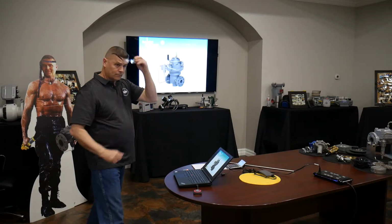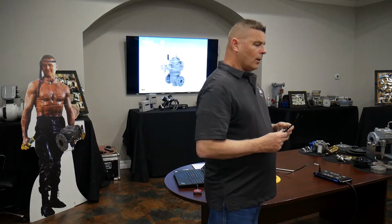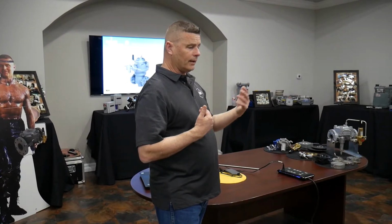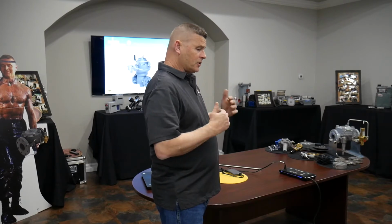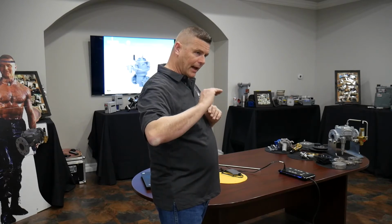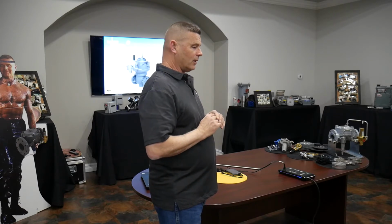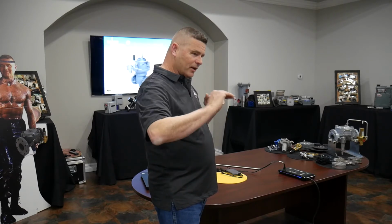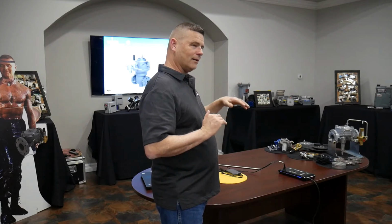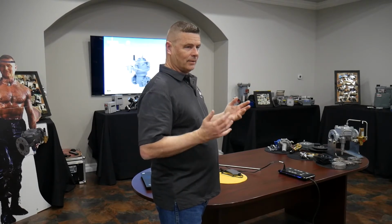Jeff, why do you think somebody would want to make a shallow cut like that with high inlet pressure? Well, a lot of times they have such a big swing in their conditions, or they're running so close to their MAOP, they don't have a lot of room. But they've got very exacting requirements on the downstream demands that they want to make sure they meet. They want to be exactly on the loads, but that doesn't require a lot of pressure cut on the upstream side, potentially.